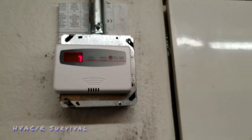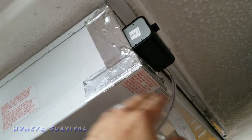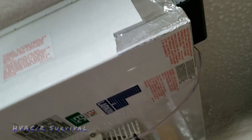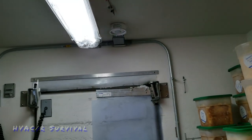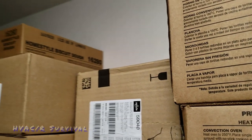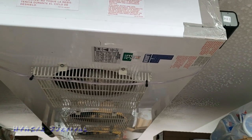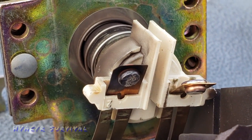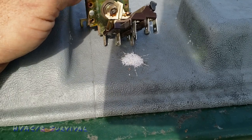So what we've got here - I had 14 degrees right there, it's not the greatest spot for the sensing bulb, so I'm moving it up to here. Probably won't make a huge difference - originally I thought we had cold air blowing on it, put some tape there to keep the air off. We brought it across and mounted it right there, trying to get it in the area it's sensing. I think every time I've come here this thing was shut down, wasn't even calling for cooling. Here's the relay that we replaced - one set of contacts there, the other one there. It's a possibility it was sticking - not opening up when it short-cycled and rapid-cycled - the interlock was not working. At this point it's the only thing I think it could be since there are no shorts and it's running. They said it was out at six o'clock in the morning, so I'd say it went out at two o'clock in the morning right after defrost. Got the insulation wrapped up to keep it dry.